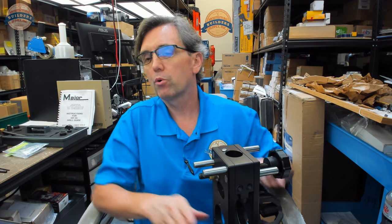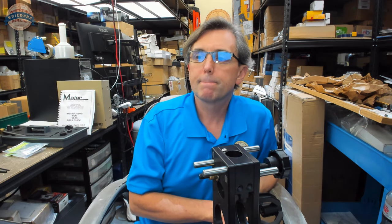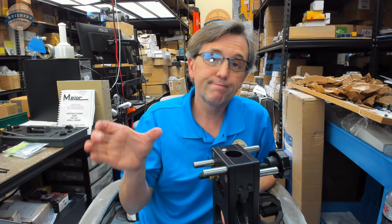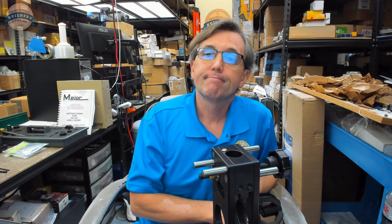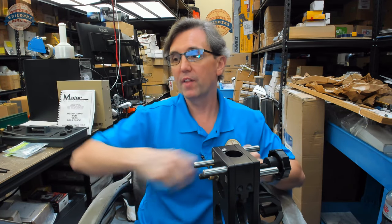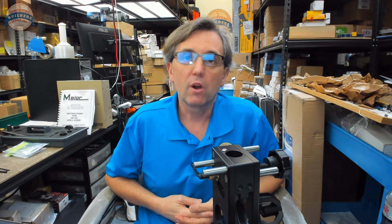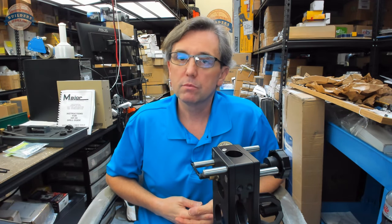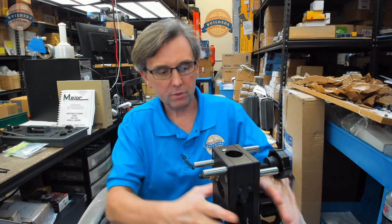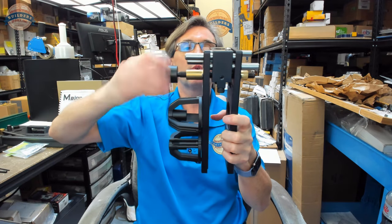You've got an inch and three-quarter thick door, and you install that latch so far over. Door reinforcer. Restyle the door. Do a full restyle. Cut all that core out, pack new wood in, plane it down, new door. There aren't wider latch bolts. That's the issue. So be mindful. They say set it back. I say set it back. So now I'm recentered again. We're in real good shape.